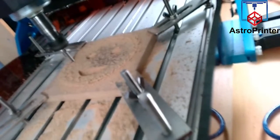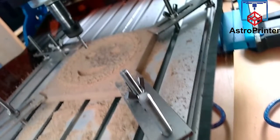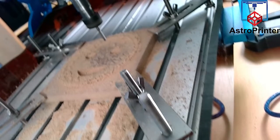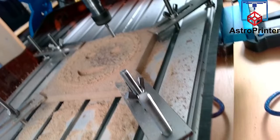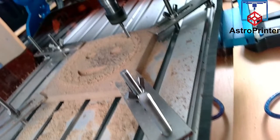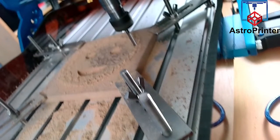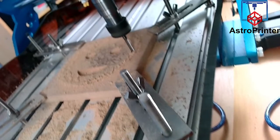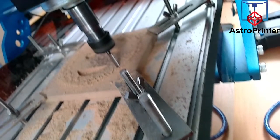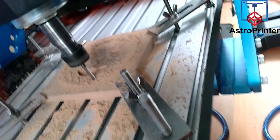The connector is keyed so it locks together. It's a square 4-pin connector, and when you line up the keys and lock it, which you should, the 4 wires were wrong. They were not oriented correctly. So by disconnecting it, turning it 90 degrees, going by the color of the cables rather than the connector itself, and replugging it together, it solved the issue. It's something I'll report to them that they need to be aware of, because if this is typical, it's been wired wrong. Apparently Jerry had to do the same with his, so we know what the issue is, and I can report it to them so they can address it, because it is a QA issue that they're doing something incorrectly. But it's not hard to fix, it's an easy one to fix.